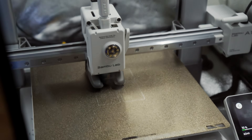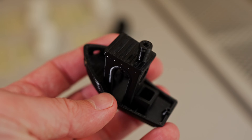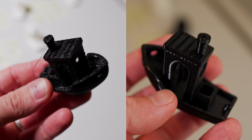Into the dryer it went — eight hours at 60 degrees Celsius, based on the dryer's TPU preset. I had seen some sites recommend 24 hours for TPU, however I wasn't super keen to leave it on overnight unattended, so I picked eight hours while I was working. Now the eight hours are up and we're printing from the dryer. The filament in the dryer is sitting at 60 degrees Celsius, 10% humidity, whilst the print tent is reading 26 degrees and 47% humidity. And my gosh, TPU is pretty when you print it right — filament dryers aren't a scam after all. This is exactly what they're for. Look how smooth this is. Almost no defects — and keep in mind I only dried it for a third of the recommended time. It's got lovely texture on the bottom from the PEI plate, barely any stringing in the portholes, and a lovely glossy finish. There's a little slumping in the bridge section, but that's a benchy with no support, so in a real-world print that would be mitigated. I am impressed.